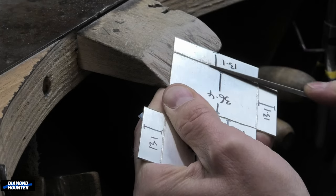When you're cutting around a corner you've got to look in two places — where you're cutting, and also where the other end of the saw blade is, because you don't want to end up tilting it. You could be following that line perfectly but the back of the blade is cutting into the edge. I help myself by rocking it backwards and forwards. Putting it on the metal block to test the cut — it's not bad. Still all scratchy from the saw blade but quite accurate, happy with that.